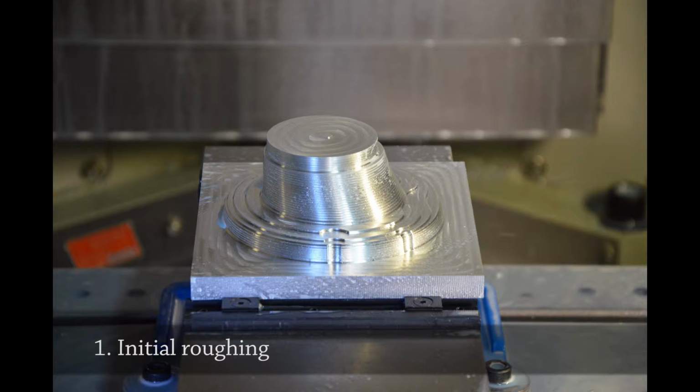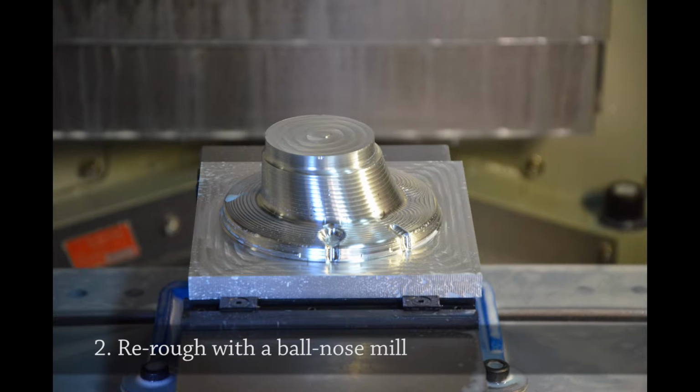This took 11 minutes of the 4.5 or 5 hour runtime to remove over half of the material so we can get the rough shape of the part. And then that shape was refined further using some end mills that have a ball nose, or essentially a hemisphere on the bottom. This allows the end mill to trace these organic and round curvy shapes a lot easier and get a lot closer. And I think at this point we're about a 1/32 of an inch away from the final dimensions of the part, and that's just going to get resolved further and further.